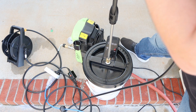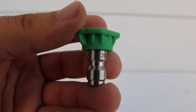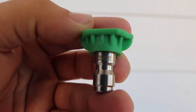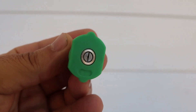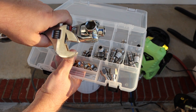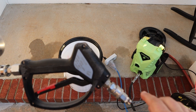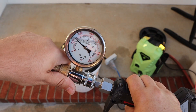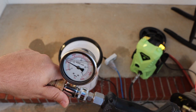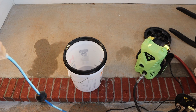GPM test shows we're about 1.4 gallons per minute. Based on those numbers, we already have a car washing setup right out of the box, but we're nowhere near the potential of this unit. The stock nozzles are a 2.6 — that's an odd size. We're going to use all the different nozzle sizes. With a 1.0 nozzle — trying for the highest PSI — the machine goes to about 1,400 PSI and just shuts off. It peaked at about 11.5 amps and kept shutting off.